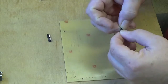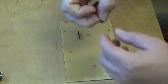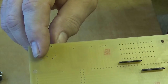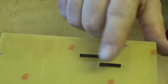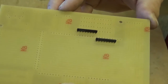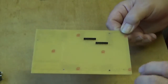Now we can take our resistor packs and solder these into the board. We mentioned earlier this little dot, which is on the left hand side as I'm holding this. They go in these two positions here. The MIDI socket goes up on the left hand side of the board, and these two resistor packs sit into those holes. You've got the four rows of holes, then a resistor pack, then the long row of holes, then the other resistor pack. As you look at the circuit board with the MIDI socket on the left, the little dots on the resistor packs have to be on the left hand side as well.